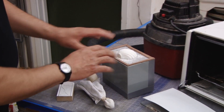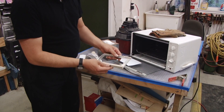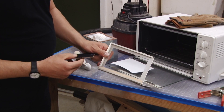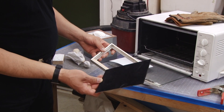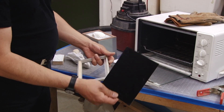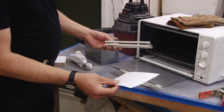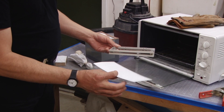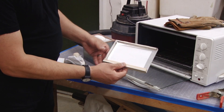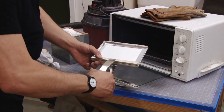So that's the vacuum side of the project. The next piece of the puzzle is the frame that holds the plastic. What I've used here is just a standard picture frame that's hinged — you remove all the glass and the cards from inside. It's a good idea to save one of those cards because you can use it to mark out the size and shape of your styrene. This is a standard polystyrene at .02 inches thickness. We stick that in there, and I've used some balsa wood to create strength so we don't collapse the picture frame when we grab it with the clip.